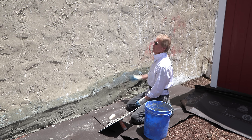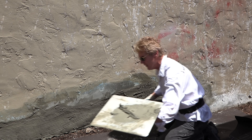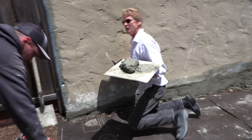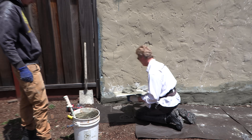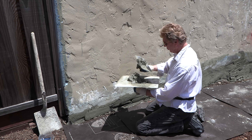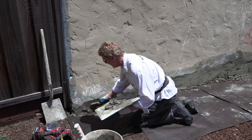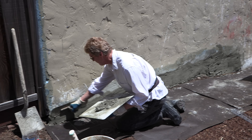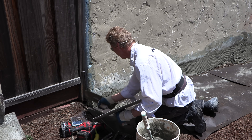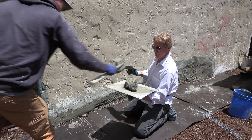As soon as we get this done I'll show you how we match Lou's finish. What kind of mud are we using? 690 BMI reinforced fiber mesh. Other materials you can use: Green Core by Quikrete — it's got fine sand and you can get it at Home Depot. If you want a heavier finish with heavy sands that sets just as fast, go Rapid Set. They named it appropriately — it sets fast, five minutes if that's what you want.